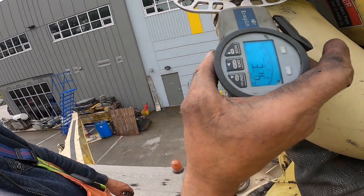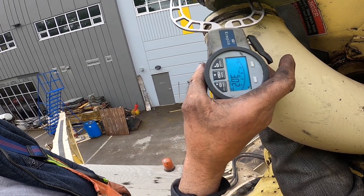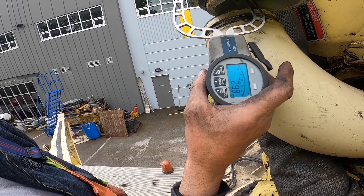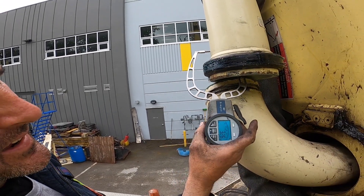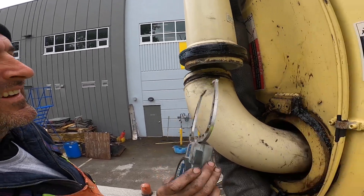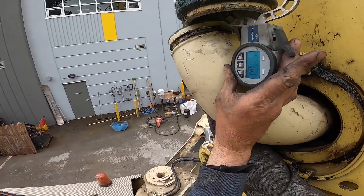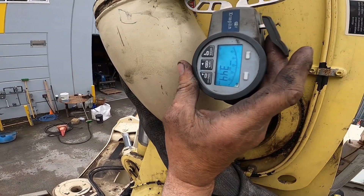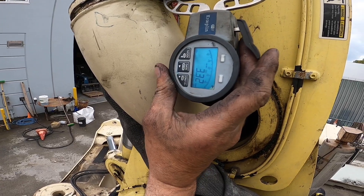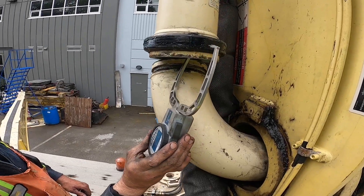It's quite dished out there — right now I'm sitting on top of that. So what are you getting? I got a 3.0 right there. 3.06, 2.98. What if you go up a little bit? Okay, now we're getting fatter — that's actually not too bad. Did you get the outside here? Try the outside. 3.4 is the lowest, I got a few at 3.32. Okay, 2.2 — that's pretty good. So we're still at three mils.